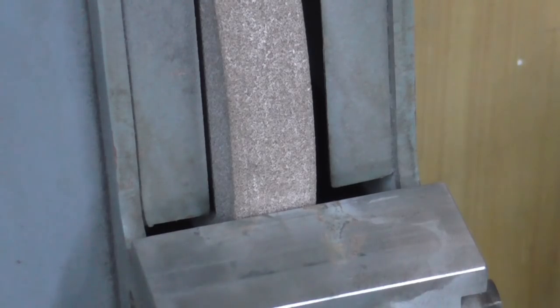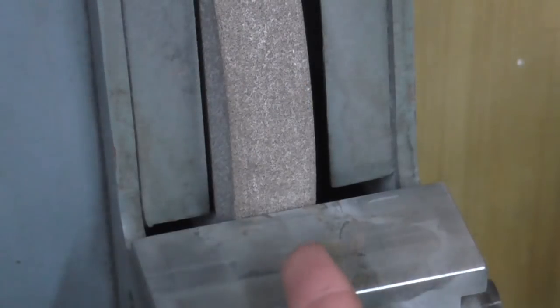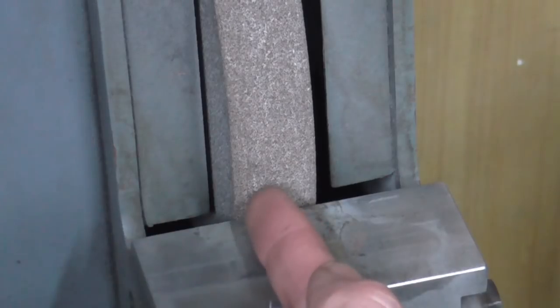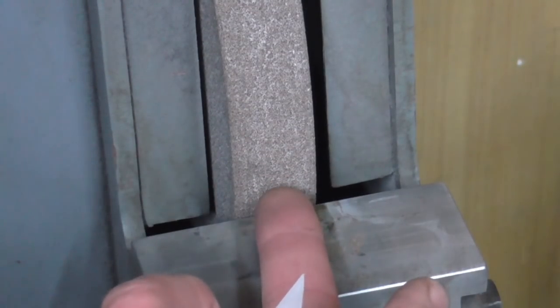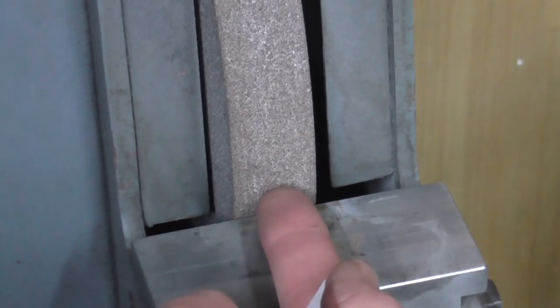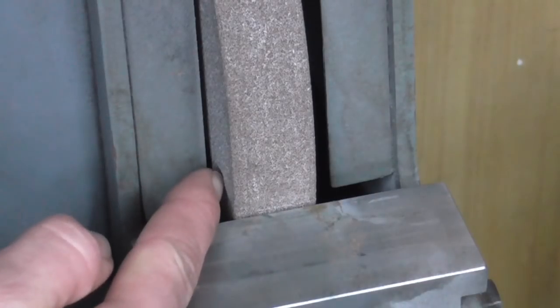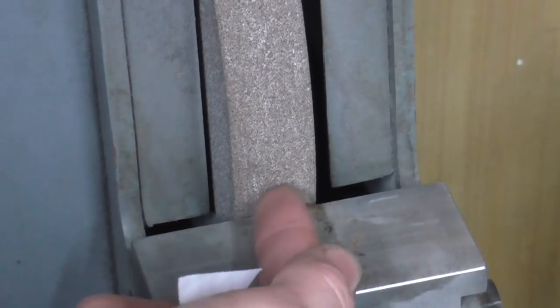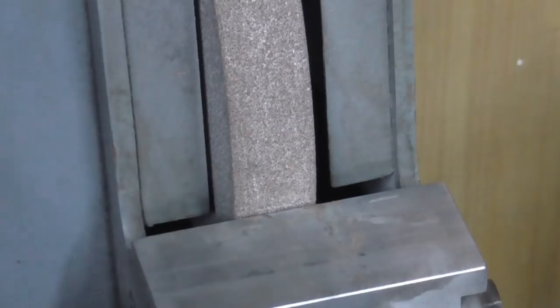To finish up, I just want to mention an aspect of grinding, that is wheel approaches and clearances. Now, I said when I was doing this that I was working on the periphery. By periphery, I mean this. This is the periphery of the wheel, this radial periphery, as opposed to the sides of the wheel. I like to do the work on the periphery, mainly because it's the periphery that wears, and when I dress the periphery, the wear's gone. If you do the work on the sides of the wheel and you start to wear the sides of the wheel down, you then have to get into dressing the sides of the wheel, and so if I can do the work on the periphery, I aim to do so.